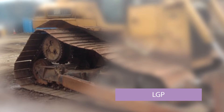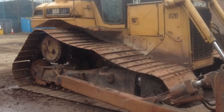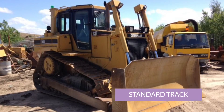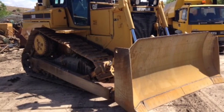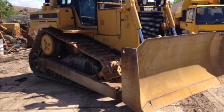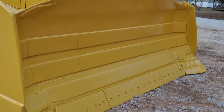If you want to see the different components of an undercarriage, check the undercarriage video. Here is an example of the same machine at the same angle, but it's just a standard track machine as opposed to an LGP. You'll notice on the LGP that the track plates stick out beyond the side of the machine — it just spreads the machine's weight over a larger area, meaning it doesn't sink in. You can use it on softer soil without causing as much damage.